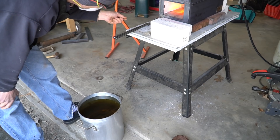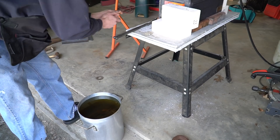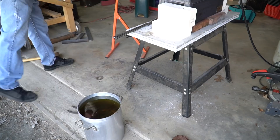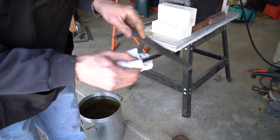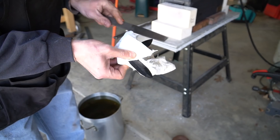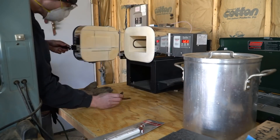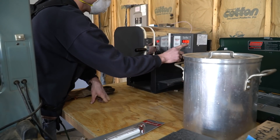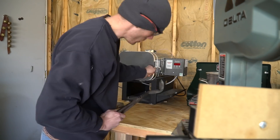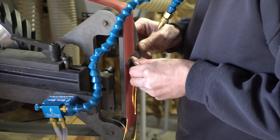All sides of this need to be hardened and you don't want a large piece of steel sucking the heat out while you're trying to heat it up. Now the last two pieces of rebar from this same piece I quenched in water; this piece I quenched in oil and I don't think it got as hard as the other two. It got hard enough to hold some kind of an edge, but it's not as hard as I'd like — I mean, come on, it's rebar. It's not 1080 high carbon steel, so it's pretty good for what it is. I threw this in my tempering oven for about 15 minutes at 400 degrees — it probably did nothing. After thinking about it, I didn't want to take too much hardness out of this piece because it barely got hard in the first place.